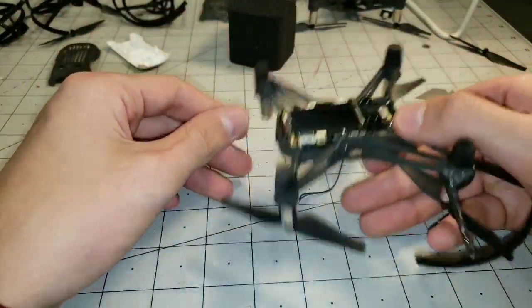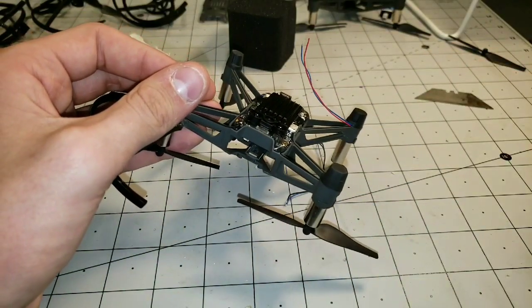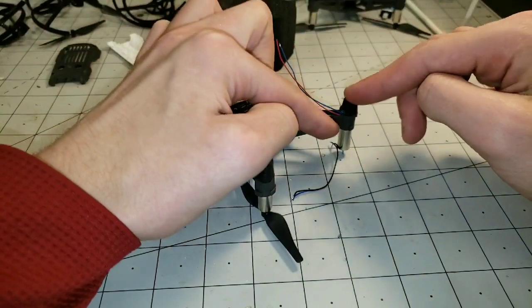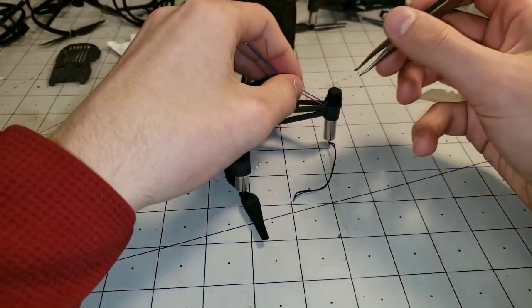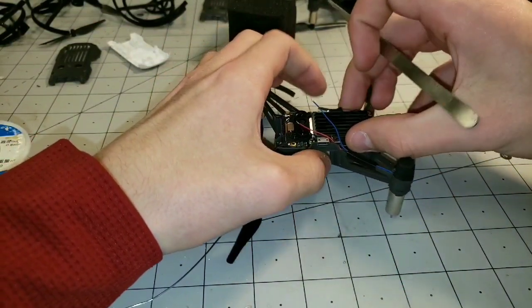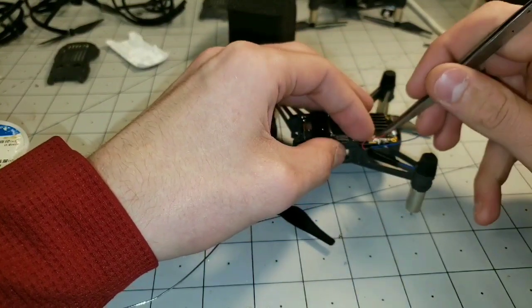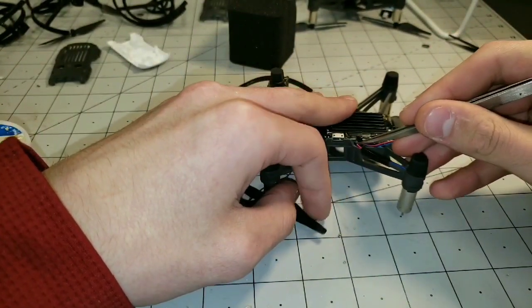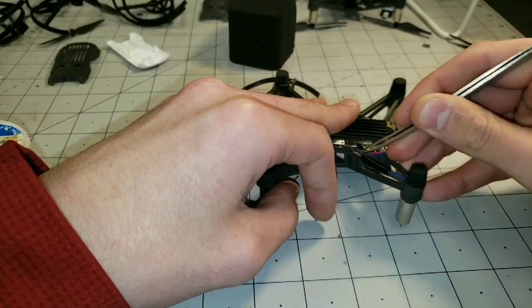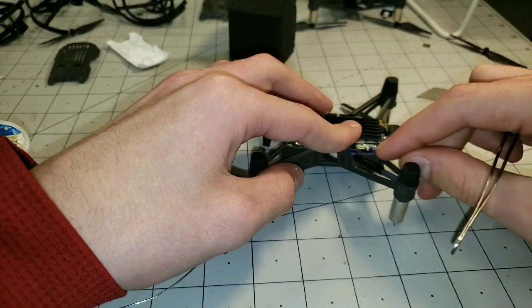So that was a little bit of a pain for the front motor — I've only ever had to replace the back motor before. The front, it seems like the hole was tiny, so what I did was take my little needle snips and trimmed the hole a little bit bigger so I could get both wires in without a headache. With these wires, what you want to do is just run those back along the arm the way they had them. We're just going to run these wires back under the flight controller and keep it neat. Take the slack and manipulate them back under there with some tweezers — try and follow the frame too, that will give them structure. Once they're back under there, let's solder them down.